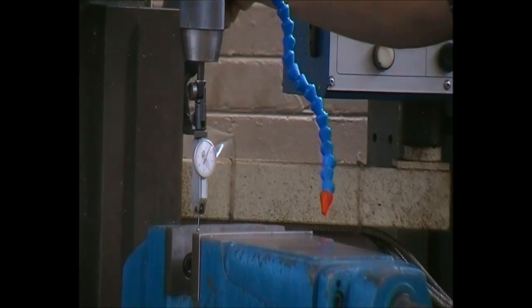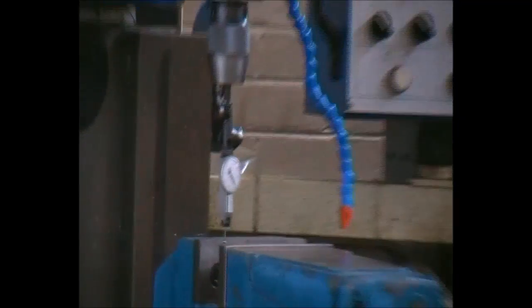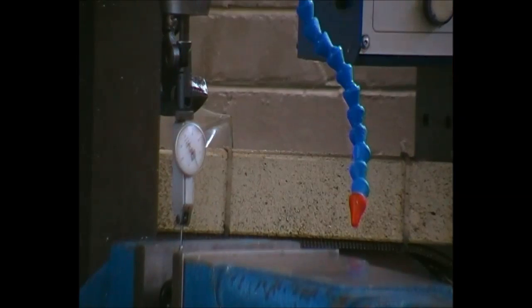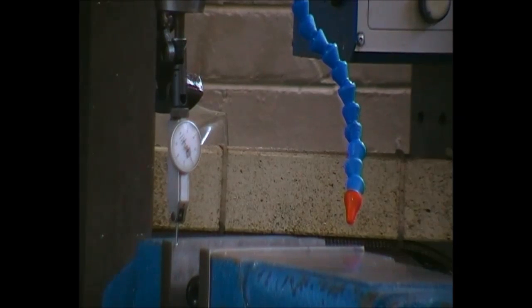As can be seen on the clock gauge, the dial moves to a certain value. This value is not of great importance but if need be it can be set to zero. As we move left and right on the device, this value must not generally be moving more than 20 microns difference.